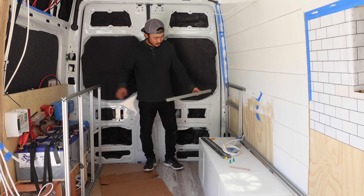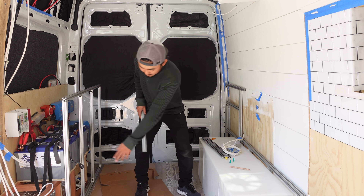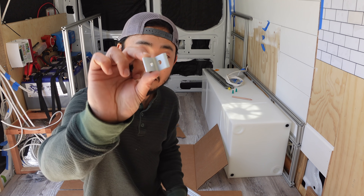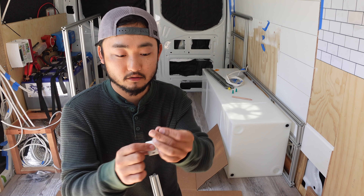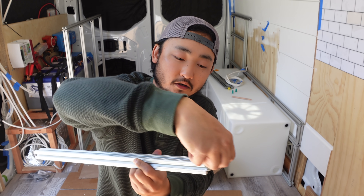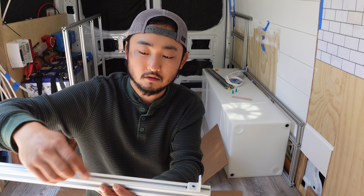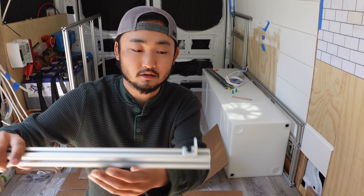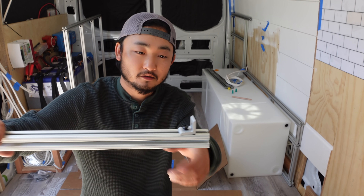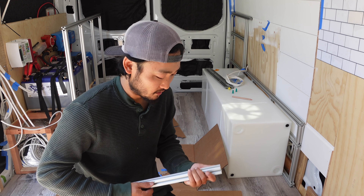I'll have a couple going all the way across and connecting up here as well, probably right around here for the bench. I have a bag of these corner brackets — two holes, just a corner bracket like that. This is a t-nut, so it goes like that — the t-nut part goes in here, slides in, the bracket goes on top, and then you just screw it down right here into that. Then you just put another piece of 8020 here and lock it in.